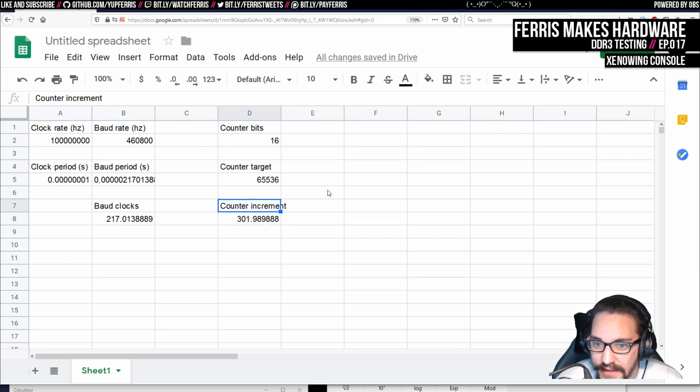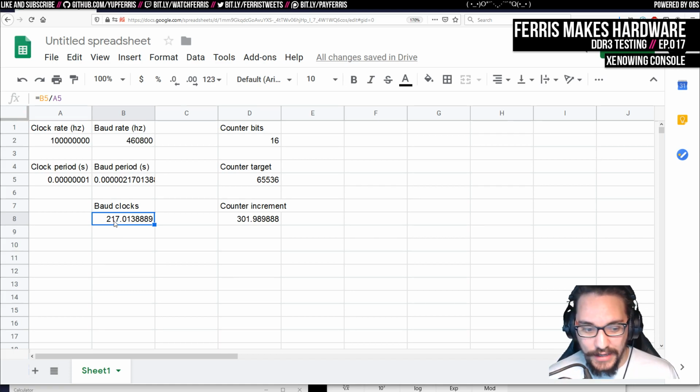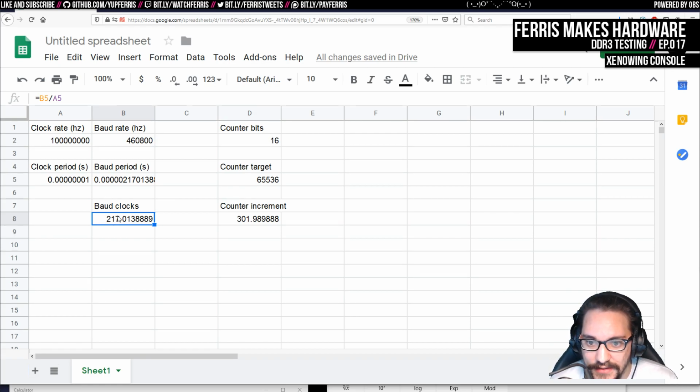But I think, honestly, we could just count up to 2^17 a bunch of times, and whenever it reaches that, then we'll just quit. And I think we're going to end up with a smaller circuit here. So even though we do a whole equality comparison for whether or not we generate this pulse, the counter should be a lot smaller. So actually, I think we're going to just end up being more minimal the way we did this.